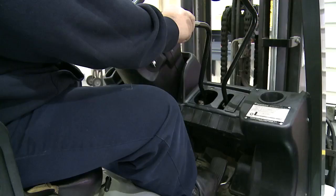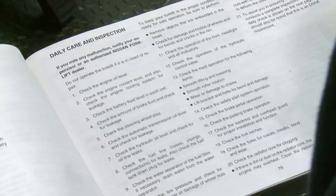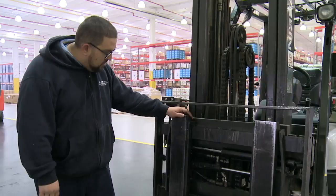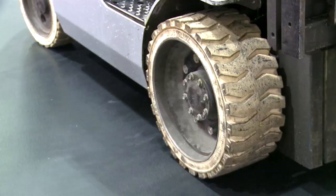The nameplate on the equipment should be present and legible. Any attachments used with the forklift should be listed on the nameplate. The manual or a copy of the manual should also be available for inspection. The inspector should look closely at forks or attachments for deformation, cracks, or excessive use. Be sure not to place your feet under the forks while inspecting.